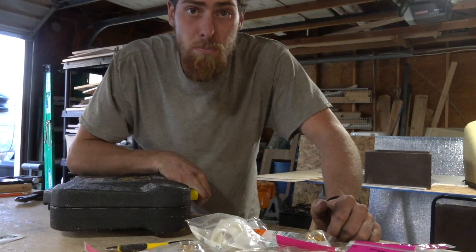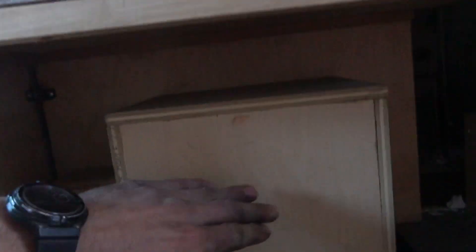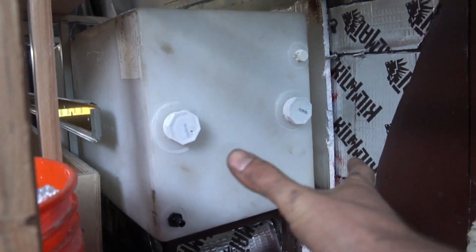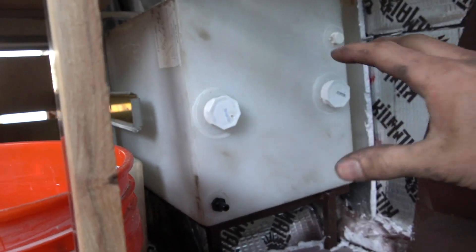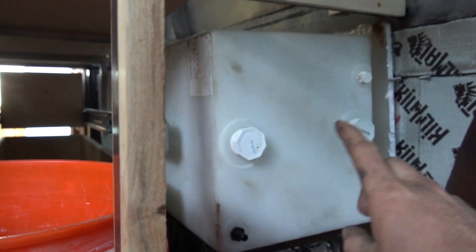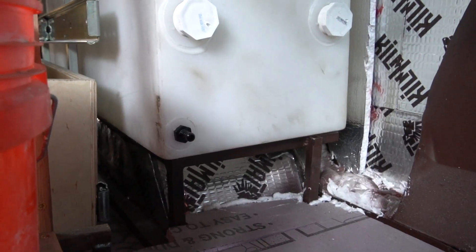I moved everything in here — there's our shower, our water heater, this is our propane tank behind here — I'm going to run the propane later. Then there's our water tank. I wish I would have ordered this water tank with no fittings, because I thought the fittings would flip sideways. This water tank is taller than it is wide, and the fittings aren't oriented the way I expected, so we're having to cap off three of them and add two up top. This is our exit point.